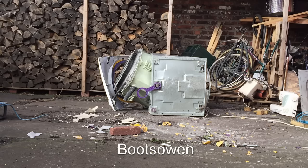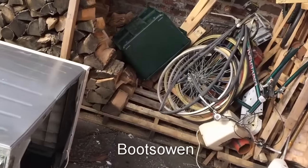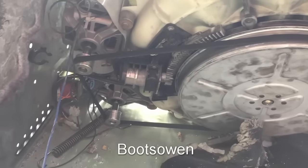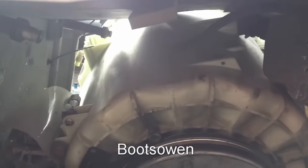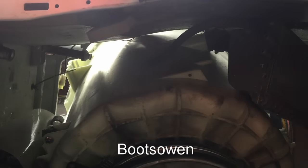It's unplugged. Got a feeling it's just a power issue again. This is just going to keep happening. Kind of feel like it's worth trying though. What have we done? We've lost our live from the connector block. Very strange. Okay. And we've lost our neutral from up there. So two things together conspired against us this time. Let's get them back together.